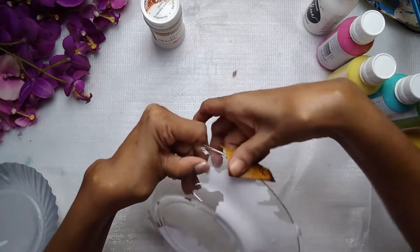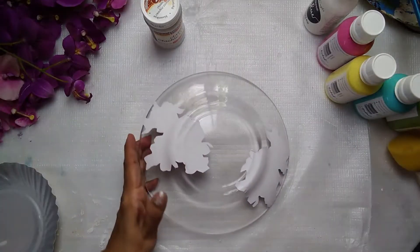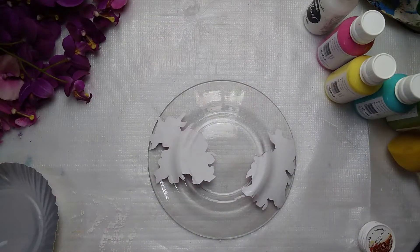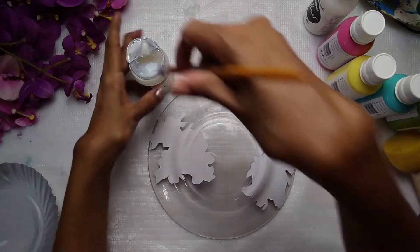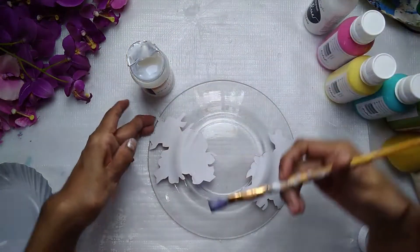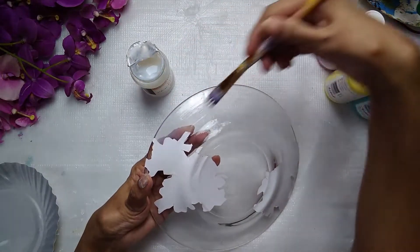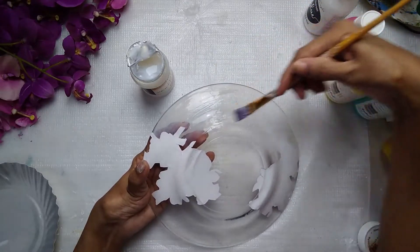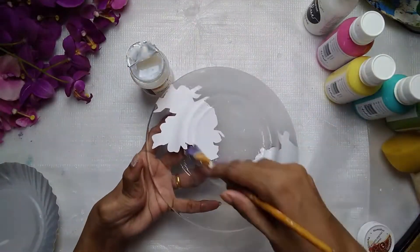I'm just sanding and removing the excess paper. Now I'll take component two, which is the top coat. With two-step crackle creams, once you put the base coat and then the top coat, the top coat reacts with the base coat and gives the crackles. I'm giving a nice generous amount of top coat - I want nice big cracks. Once you brush, do not go over the same area again.